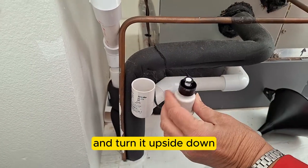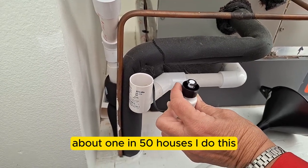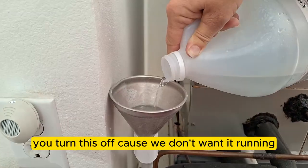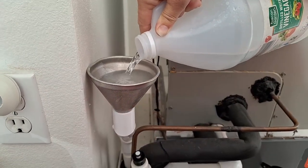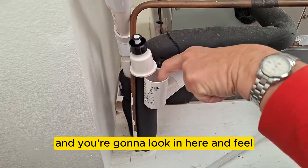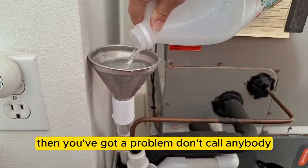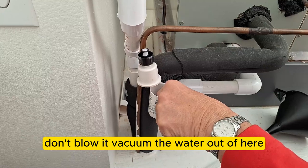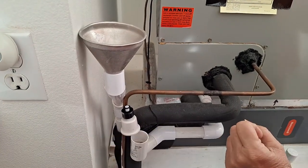There's also a safety float valve in the drain pan. If the condensate line gets clogged, water fills the pan, the float rises, and your heating and cooling system will not operate. You should occasionally flip that float upside down to test whether the system shuts off — in about one in fifty houses it doesn't work, meaning the safety valve is faulty. If you come home and the system isn't working, check this pan first — if there's water, use a wet-dry vac to vacuum it out before calling anyone.